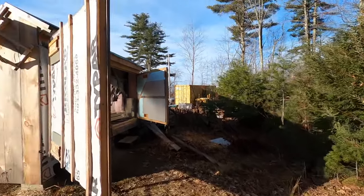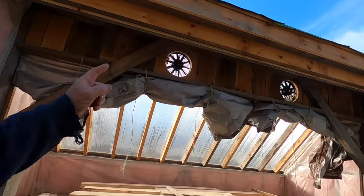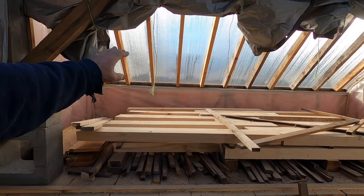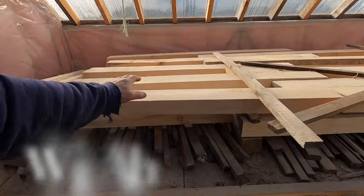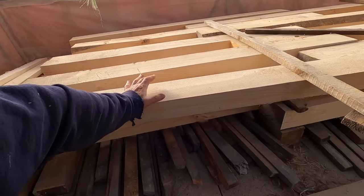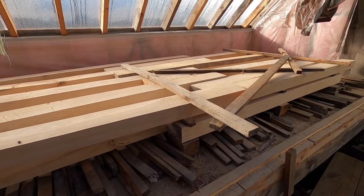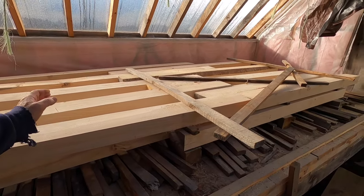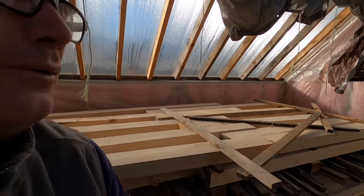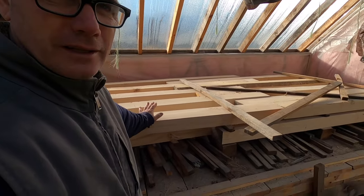So we've got the tractor with the forks here in the back of the kiln. You can hear the fans are really working good. The kiln was filled with this material, which is about 5.5 by 3.5, and it's actually all of the wind braces for the timber frame building. And I had a bunch of boards stacked in above it, and they were down to like 12%, and I'm like, I gotta get them out of here so that I can get to this stuff.